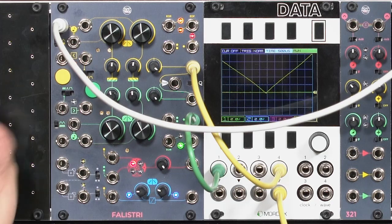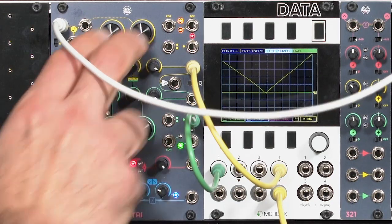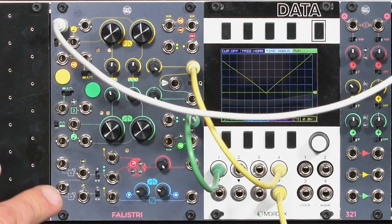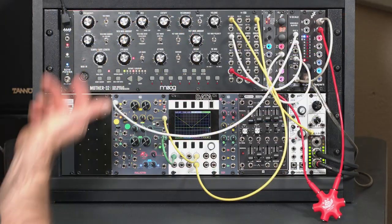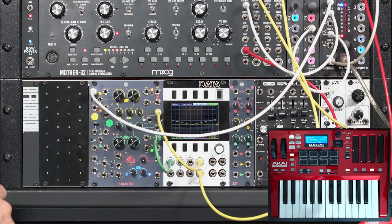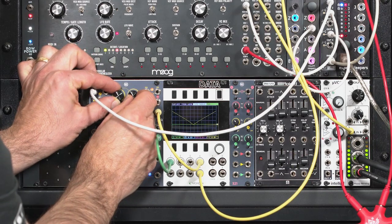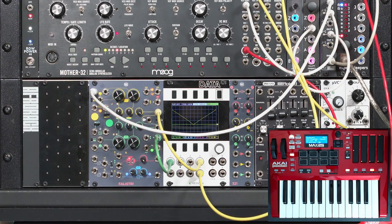Now here's the trick. To track well, you need to keep the rise and fall times as similar to each other as possible. You want to adjust them together to make it a triangle waveform, then use the shape controls to alter that waveform. So to tune it initially, I'm going to bring up the oscillator on the Moog — mix it in — and tune these together.